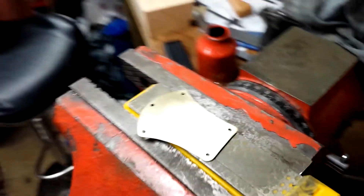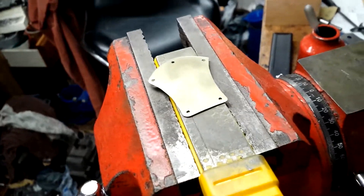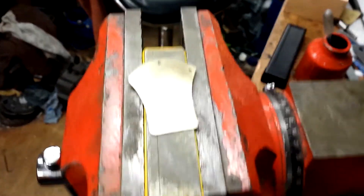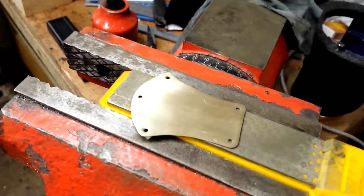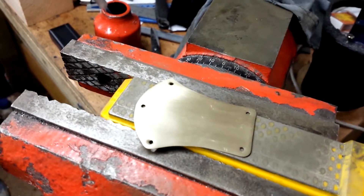It's definitely coming, but I've got a few more scratches to polish out. I just have to keep working this and try to get it as smooth as I can. There's going to be some tolerance in this anyway — with oil between the plate and the cylinder there's inevitably going to be some degree of tolerance. It's just that my inexperience doesn't let me know how much. So it's going to get a good lapping, but getting the scratches out that way is just dispiriting.